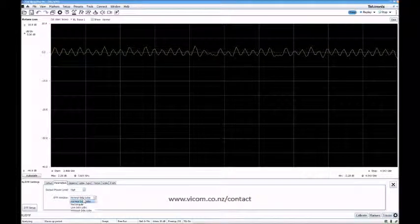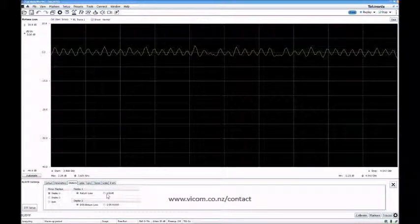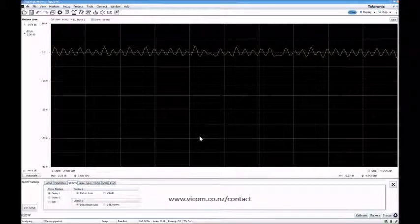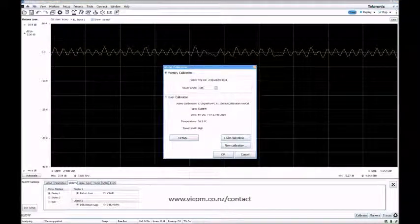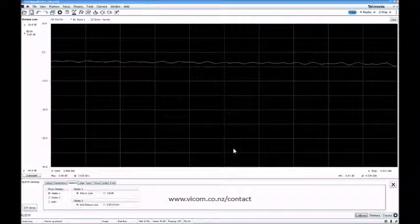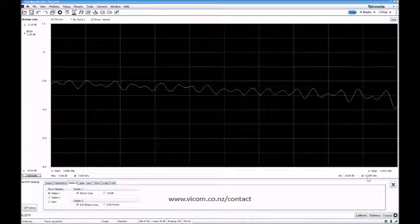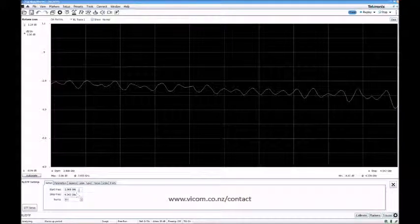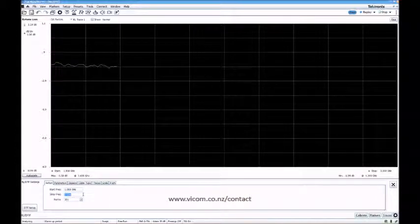So we have this one, nominal side lobe or minimum side lobe, output level high or low. These are 2 options, and displays. We can look at return loss, standing wave, or distance to fault return loss, or distance to fault standing wave. Just a different way, because there's a relationship between dB and the standing wave numbers. So I have some cables, and let's see if I can look at the antenna. We look at the return loss right now, and we make sure that I go into calibrate and use the factory cal. Factory cal is like this, perfect. We auto scale, and we can see that the minimum is 4.82 dB at 4.5 gig, and I want it to be 1 gig to 3 gig.